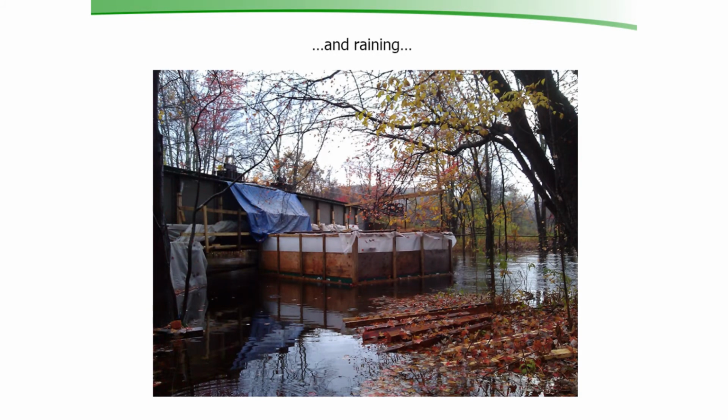Once we had the cover plate off, we had to remove it from the bridge, and we had to put the new one down there. We couldn't put anything on the bridge as far as equipment goes. So what the guys did is he built this system of bunks. They're 4x4s, and got the first cover plate, which is, you see here, some of the rivets are removed, dropped it down, slid it out, pulled it over to where they could attach something to it, mechanical, lifted it up, and the new one went in the reverse process.